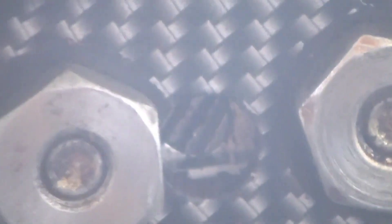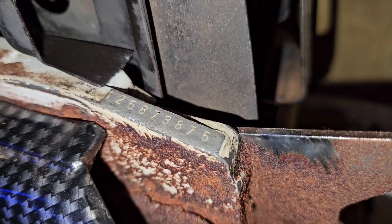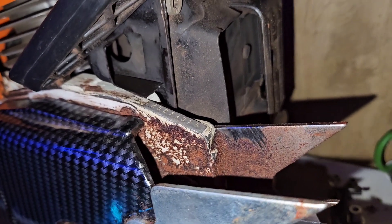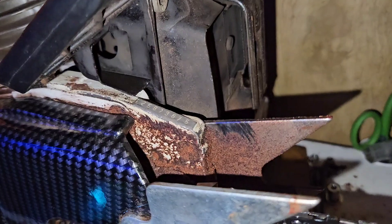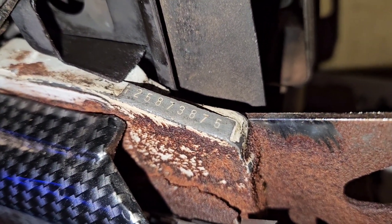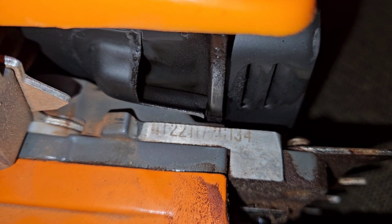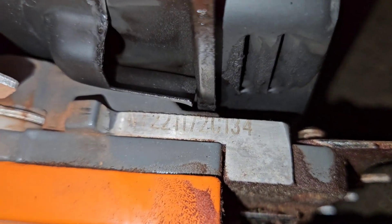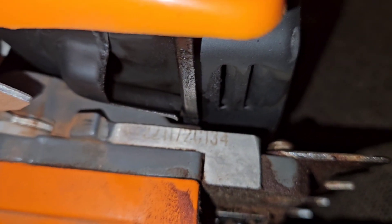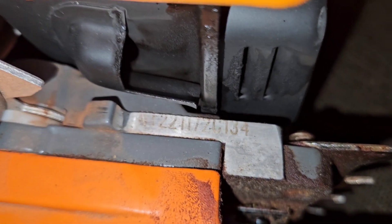Just loosen those two bar nuts and it's that screw right in there. And there's that serial number for anybody that wants to see proof that it's OEM. You'll typically find the serial number on these Stihl saws and clones right here next to the muffler. A style like this indicates real Stihl slash OEM, whereas on an aftermarket saw or Chinese clone Stihl saw, you will typically have a serial number style like this — sometimes no serial number at all. Just something to be aware of when you're buying clones or real Stihl saws so you don't get scammed.